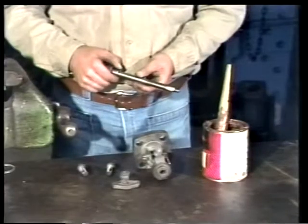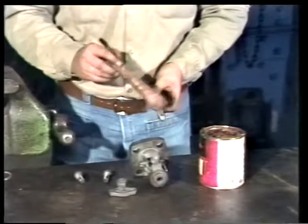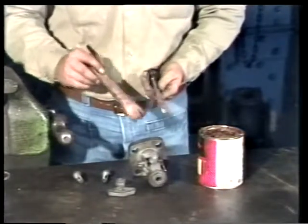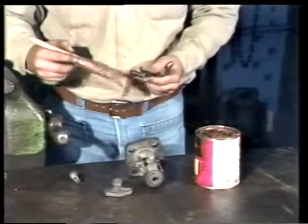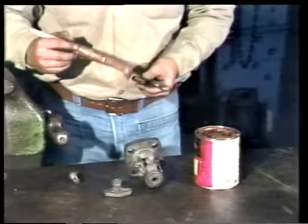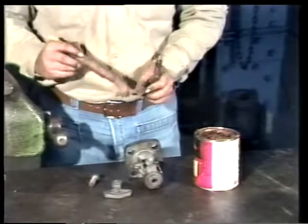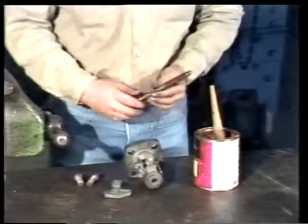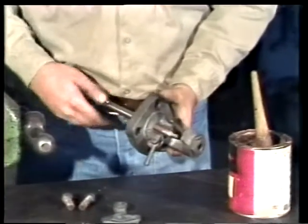With the cleaning and inspection complete, we are ready to reassemble this valve. An important step in putting a valve back together after repairs are completed is lubrication. All moving and threaded parts should be well lubricated during assembly. Many lubricants, both wet and dry, are available, so be sure to use the appropriate type for each surface. Keep in mind what the valve will be used for.